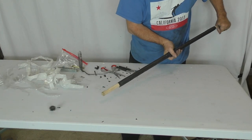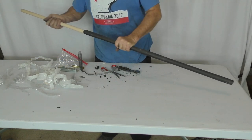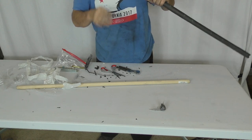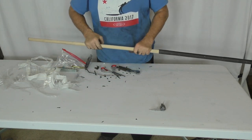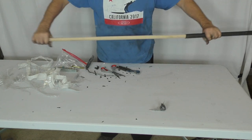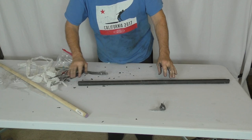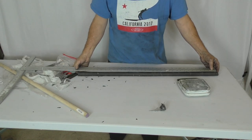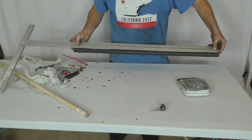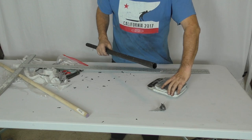Here's the trick: I got a piece of wood dowel that's the same size as the inside of the tube. Because it's solid rather than hollow like the mandrel, it can get a hold of the edge of the plastic, crumple it up, and shove it out the other end. The finished tubing weighs, at the single layer of thickness, only about 4 tenths of an ounce per foot — really lightweight and very strong in torsion. I'm measuring here to cut it in half on the doubler, ending up with two pieces of tubing that have doublers at each end. So there's the basic process.